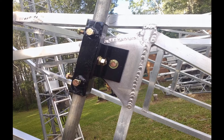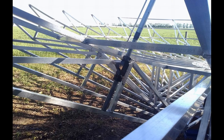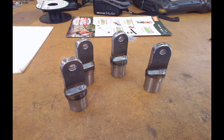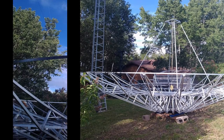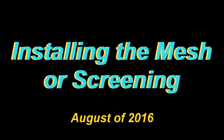In between installing these rings the mounts for the feed arms were also installed. The feed arms themselves were made out of 1 inch electrical conduit which I had to extend, and at the ends there were special brackets made for the top mount to hook to. The square frame at the end was just a bracket to hold the arms together — it had nothing to do with the actual feed mount. Before the mesh work was done I installed the tower frame into the ground, but we'll get into the mesh work first.